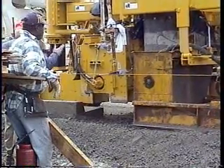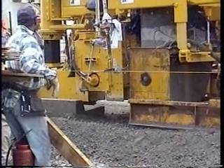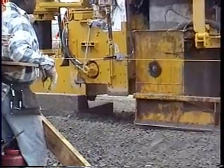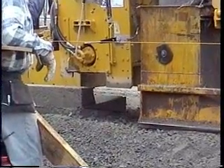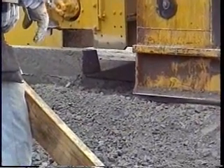The trimmer head is side shifted. And with the hopper volume monitored, the mold can be lifted off with exact placement and no waste of material. At an inlet, the machine can pull ahead and start paving on the opposite side without ever leaving the string line.